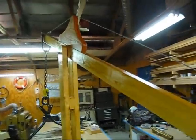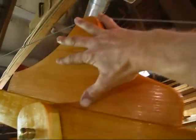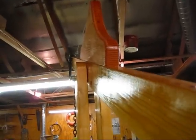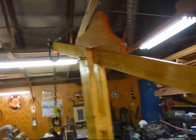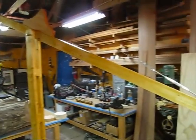So I made this lever arm a lot stronger without adding much weight — just the weight of the aluminum turnbuckle body, the cable, and the spacer here. This section is about 9 inches from end to end. You can tension this cable with the turnbuckle and actually put a little bit of a dip in the lever arm — enough pre-tension to form a slight reverse curve in the 2x4 — and it's going to make it a lot stronger. When I lifted that 160-pound log I didn't like the way it was bending, but now with this in place I won't be worried at all about this lever arm breaking.